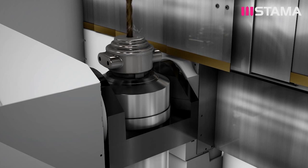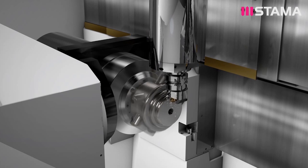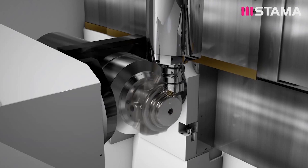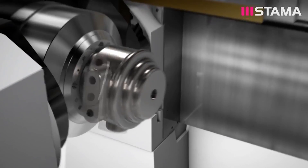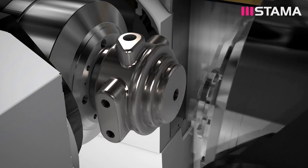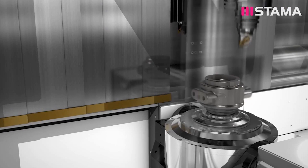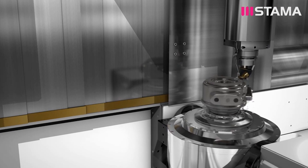Is there any difference between the left-hand and right-hand on this machine? Sometimes with twin turret machines you have a smaller secondary spindle than the main — or is this identical from one side to the other? They're identical, so you're running HSK 63 up to 16,000 rpm milling spindles, and turning spindles up to 4,200 rpm with up to 43 kilowatts — so they're powerful, true turning spindles as well.